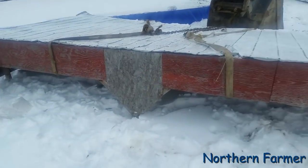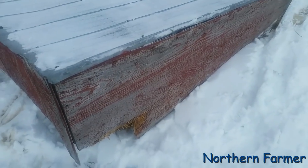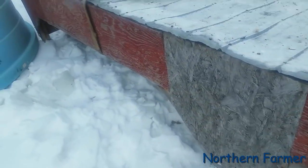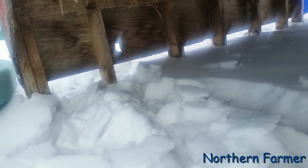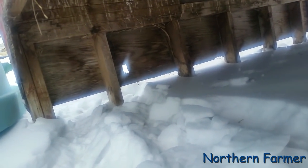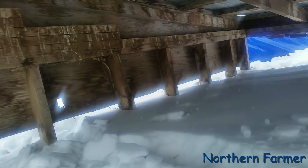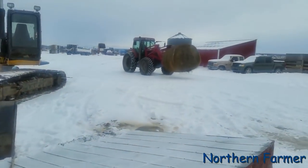I just put a couple of straps and a chain around it and lifted it up. What I'm going to do is pull off that plywood and put our own treated plywood on it. I cut the old wall off with a power saw, and I'm going to have to cut those off right to the top of the end cap of the wall, because we're going to set it on the new wall. There's nothing really wrong with it, so that's why we saved it — that's what we're going to accomplish today.